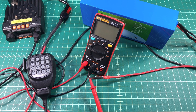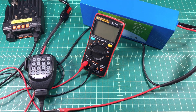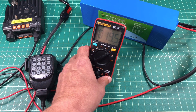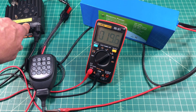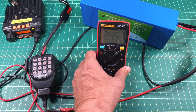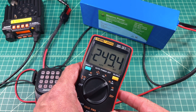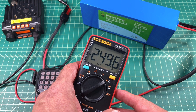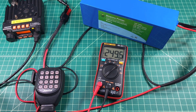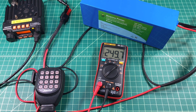Okay, the next thing we are going to do is plug in the battery — there you go, the battery is plugged in. We are going to turn our multimeter to DC amps and then power up the radio. Okay, everything is working. So what you can see is that right now we are at 249 milliamps, and that is just the steady draw — that is what this radio consumes from a current standpoint when it is sitting idle.